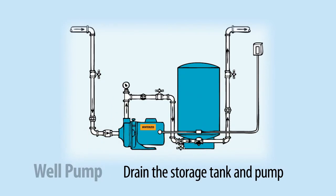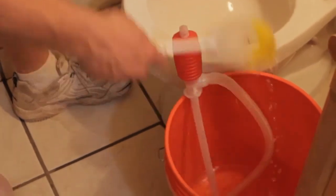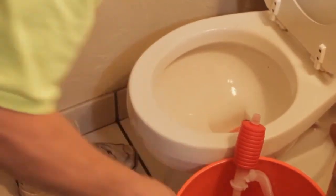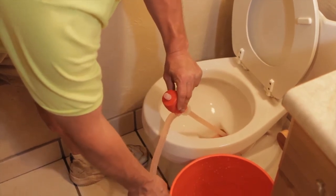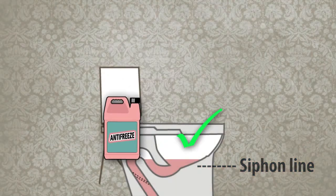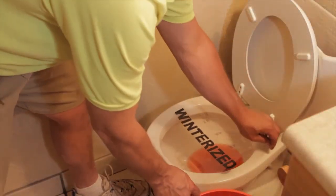Place a winterization sticker on the pump so persons entering the property know the unit has been shut down. The next step in winterization is to add antifreeze to all toilets and drains. Toilets must first be cleaned — for pre-sale properties, toilets need to be clear of feces and urine. Once cleaned, remove the water in the tank and bowl; for best practices, use a hand siphon or wet vac. After all water is removed, pour non-toxic antifreeze into all the toilet bowls above the siphon line, and also into the toilet tanks above the rubber flapper. Next, winterization wraps are placed on each winterized toilet.